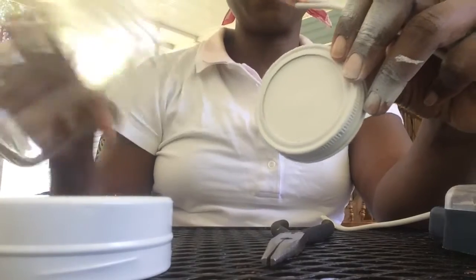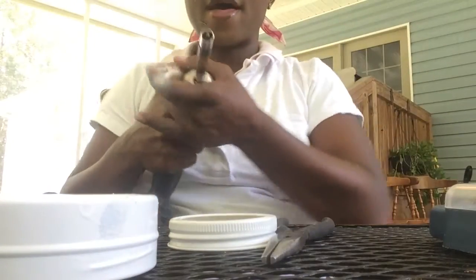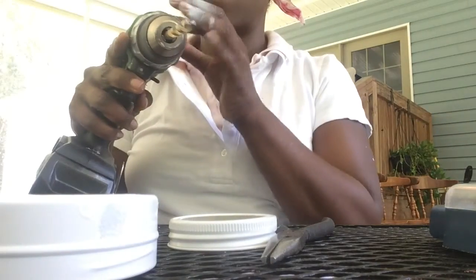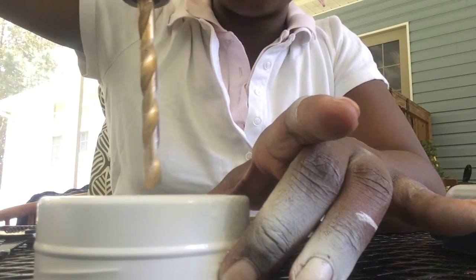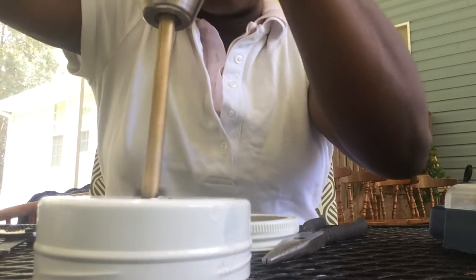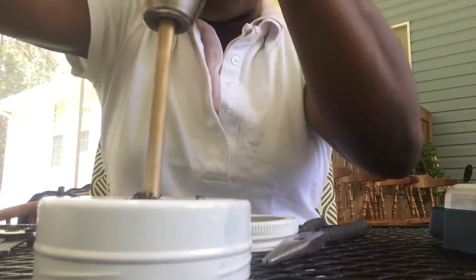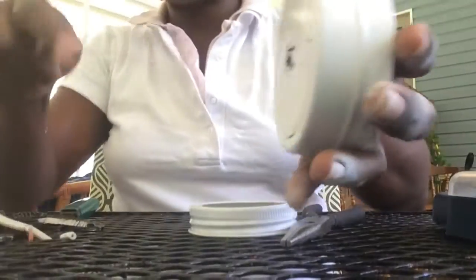This is the base of our mason jar fixture. We need two holes — one coming out of the base and one going through the top. I've got my cordless drill here; I recommend you have one too. It's the fastest method. I'm eyeballing the center — it doesn't have to be exact when it's up in the ceiling. If you want to be more precise, totally measure it off. Be careful not to put too much pressure; the hole also serves as a bushing for your wire. Test the hole to make sure the wire can come through easily.